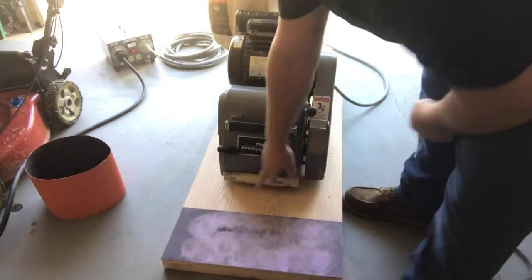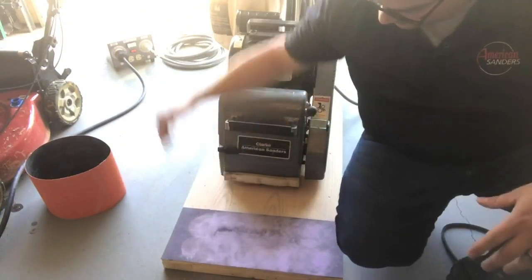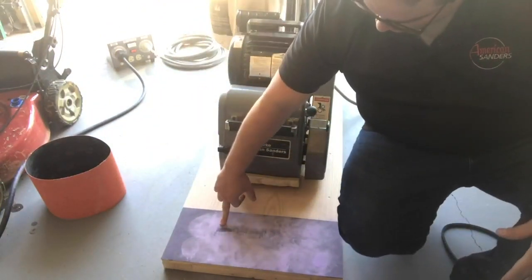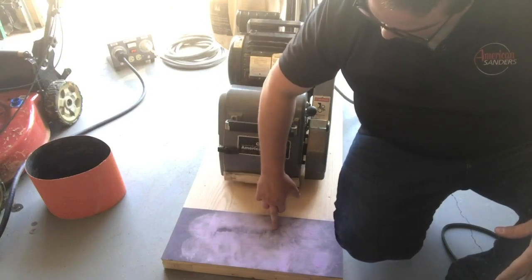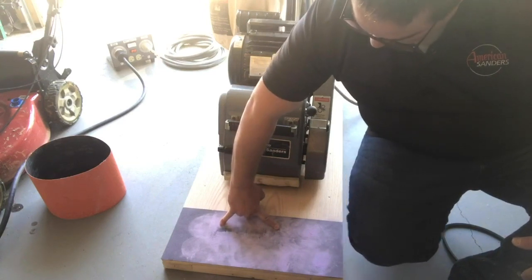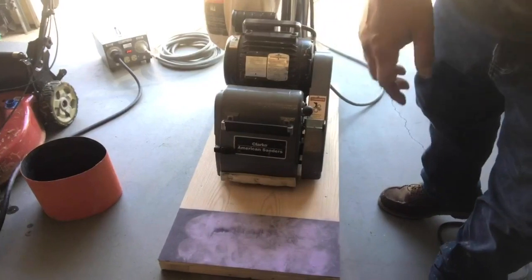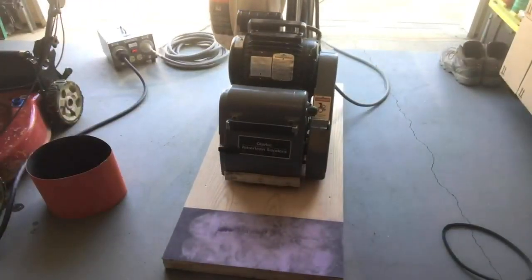If you look, we're cutting a little heavy on the right side — looking at it from behind the machine, a little heavy on the right side. We do have some contact here and here. You can definitely tell that you're pretty close to cutting the entire width of the drum. First thing I'm going to check is on the side — I'm going to check my level adjustment.